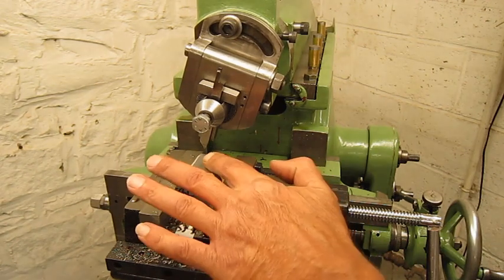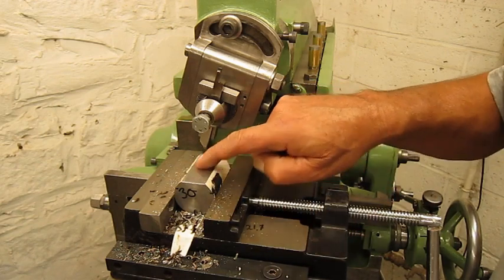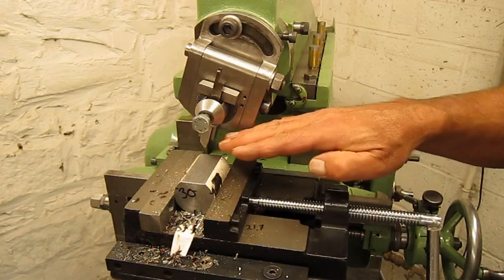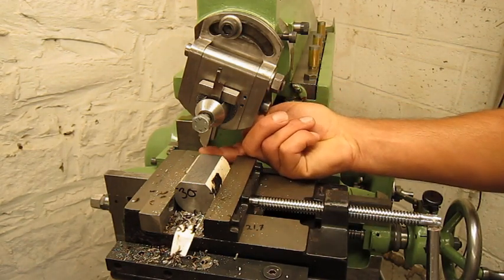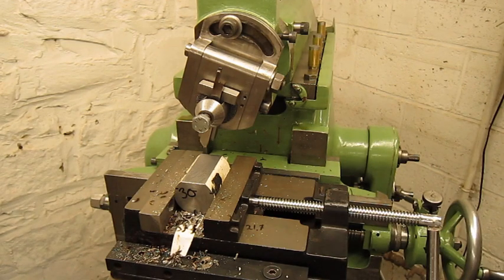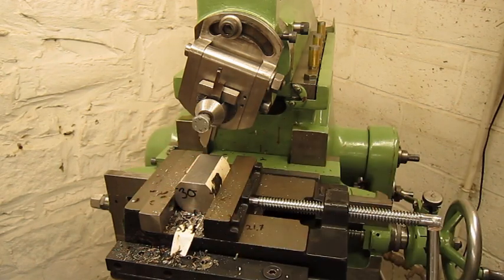Of course, at this speed, if something goes wrong, it's gonna cost us money. Yeah, the finish is way smoother. There's a bit of a wave-like finish on it. Maybe my tool died a little bit on the previous pass. I'm gonna regrind the tool and do the test again. Not the test again, just continue. Now it's obvious that the cutting speed is important for the surface finish.